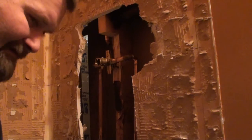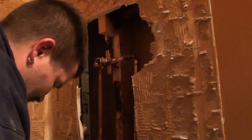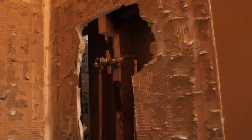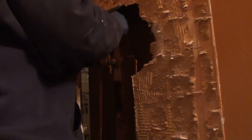Again, normally I'll do my hot and cold water line and then solder my valve in place, but because it's kind of moving back and forth, I'm going to do my shower head first, before I start soldering stuff. Normally it'd be hot and cold, solder the stuff together, and then start working on my shower head riser and my tub spout. But this is going to make everything square and level so that I don't have to sit there and hold it, all that good stuff.